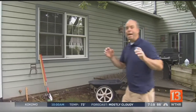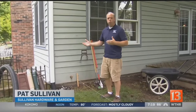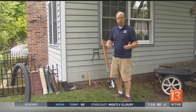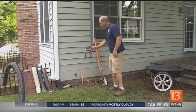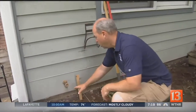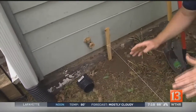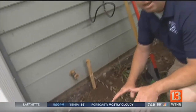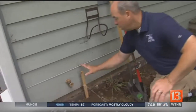On my monthly inspection at neighbor Ted's, I discovered something. With all the rain we've had — and it's unusual to be dealing with gutters, water in crawl spaces and basements in June — but checking out Ted's yard, you can see where they filled in an addition a few years ago and it kind of sunk. Ted literally has a negative grade, with water running back into the basement down along the foundation.